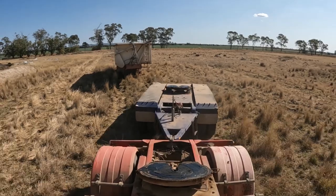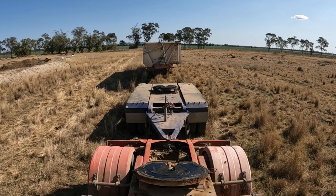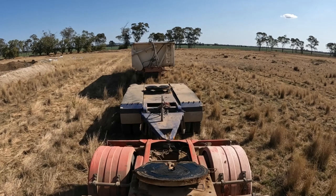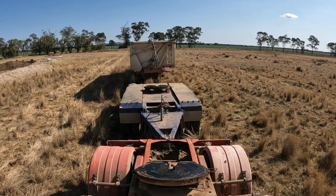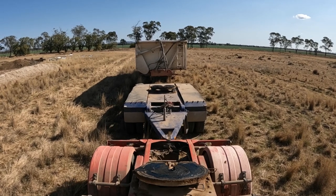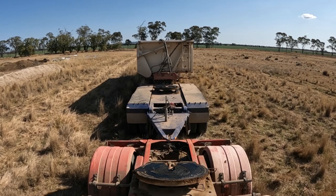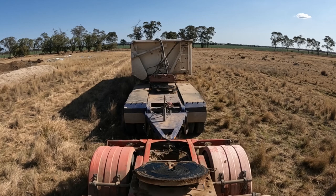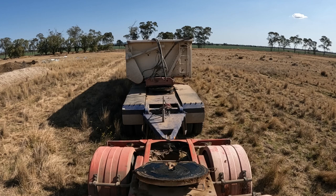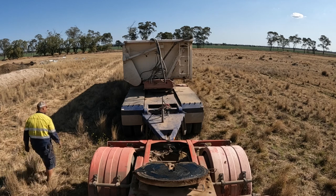Anytime we're bobtailing a dolly, even behind a trailer or system like this, we don't turn our valve on for the brakes, to lock the brakes on when you put your pressure foot pedal for the brakes, because the brakes on the dolly will lock up. Some people have flipped trailers and done some really weird stuff, and apparently it's not that hard to do. So if you ever see a dolly bobtailing, or you're going to tow a dolly bobtailing, just turn that brake line off so your brakes won't be working.